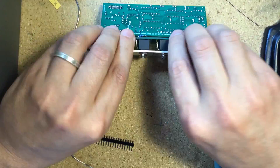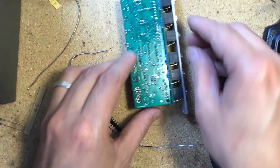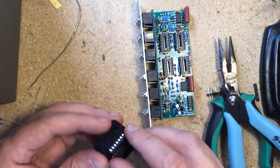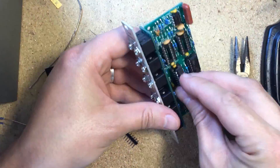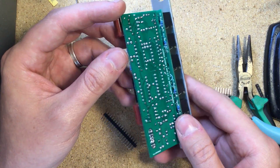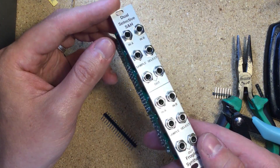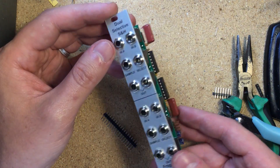It felt like I was going to break the PCB and it just barely fit without making any shorts, so I don't recommend you do this — just get the L header. Stick the ICs into their sockets making sure they're correctly oriented and you're done. As usual, check your power connector for shorts and plug it in to test it. That's it for right now. Stay tuned for the demo video coming very soon. See you later and stay noisy.